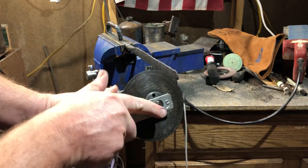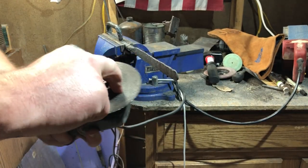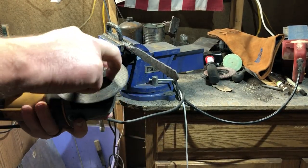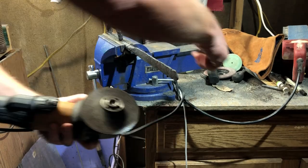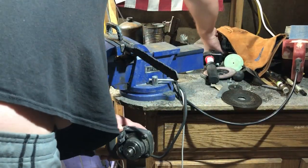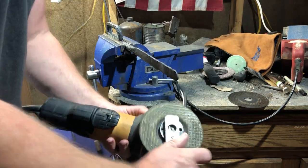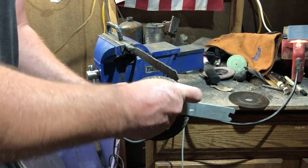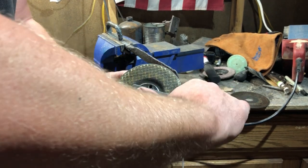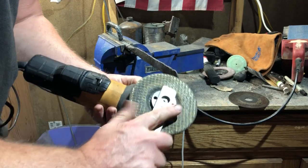But in this case, for a weapon that's designed for really rugged use in trench warfare, I would think that the toughness of the metal is probably more important than the edge retention. As I understand, in World War I — as with wars in general — there's a lot of downtime and a lot of boredom. I would think that the soldiers would have had plenty of time, certainly at least once or twice a week if not daily, to tend to the maintenance of their weapons. So having a blade that's tougher rather than one that holds a better edge seemed like the logical way to go.